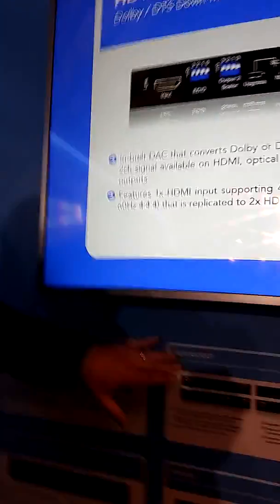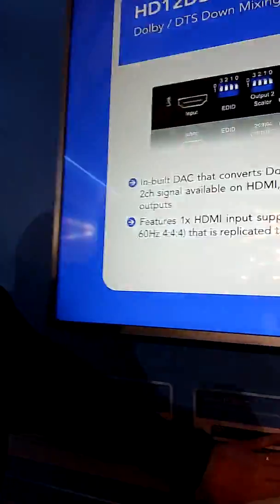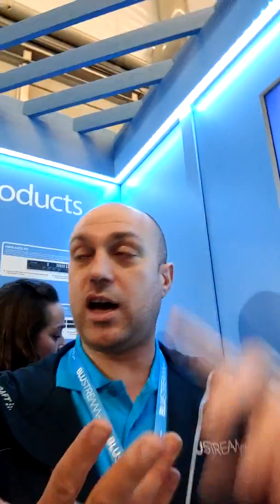Moving on quickly, the Hex 150 CS kit is our new long-range extension HDBaseT point-to-point kit. The receiver of this is used with the new Platinum V3 that will be coming out later in the year. It's a full 5-play feature set point-to-point extender kit, giving you bi-directional power over HDBaseT, full 4K 60 4:4:4 up to a distance of 100 meters, 150 meters at 1080p, 10/100BaseT Ethernet LAN serving at the same time as your audio and video, 2 IR, 2 RS232.